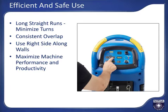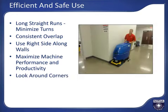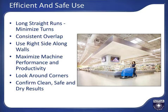For example, if the floor is reasonably clean already, you should have solution level, detergent level, and scrub pressure set at low levels, and only increase them if a heavier soil load is encountered. Pay special attention to blind corners to avoid a potential collision. Finally, regularly examine water recovery and cleaning performance. If you are not leaving floors clean, safe, and dry, make the necessary adjustments to the machine or squeegee.